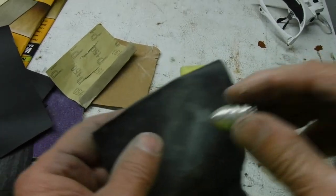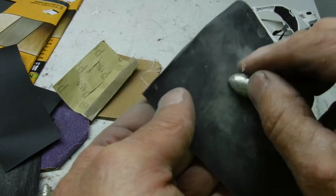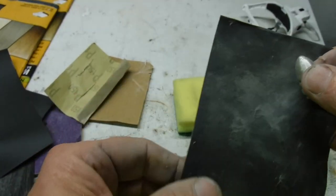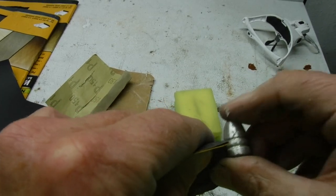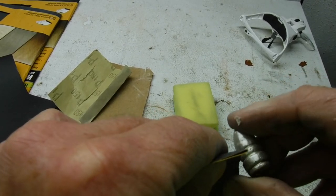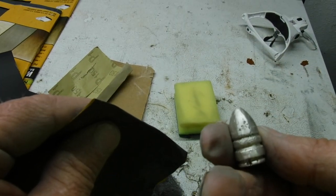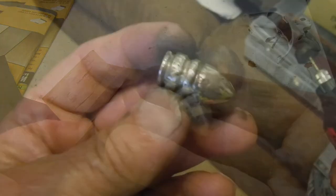We're working on it down to 400 grit now, just doing a little final touch-up on this particular one. We've still got to go through the other two bullets too, but right now just playing with one to get the process down. Look at that — it is looking pretty. I like it. She's really shining up. For the grooves I'm folding the sandpaper and going through each groove to kind of clean it up so when we buff it out those should buff out nicely too. We're getting close to the finished product.